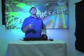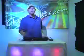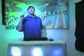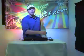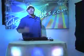If you're hearing my voice again, that means you got all your lights plugged in the wall, you checked them out, you got your daisy chain hooked up — all that stuff — ready to address the lights. What you're going to do is start with your first light coming out of your controller. That's going to be considered light one, or scanner button one, according to your DMX controller if you're using the Acrobat or just about any other manufacturer's brand that's similar.